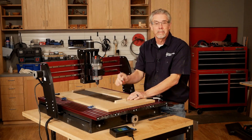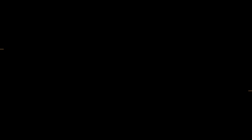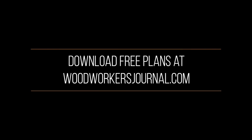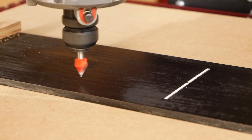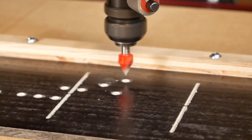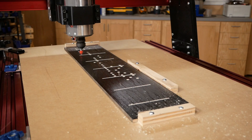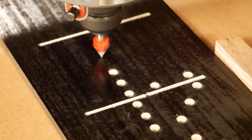With the board in place and secure, our first cuts will be made with the V-bit. All the programming for this project is free to download from our website. The V-bit will engrave the slender lines between the two faces on each tile, and it will also drill all of the holes — and there are a lot of them. I have painted this piece of stock black, so the holes stand out in relief.